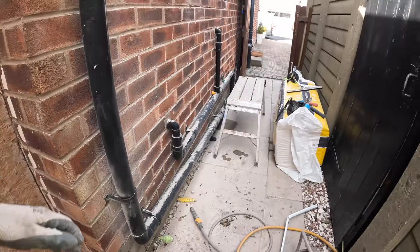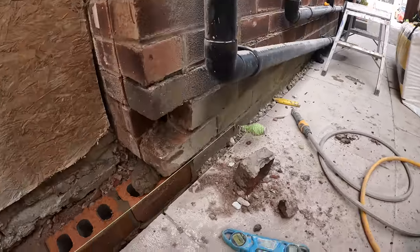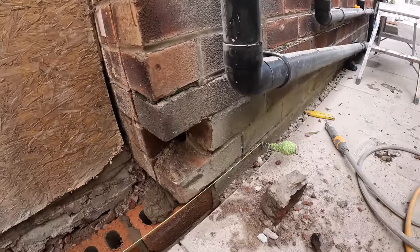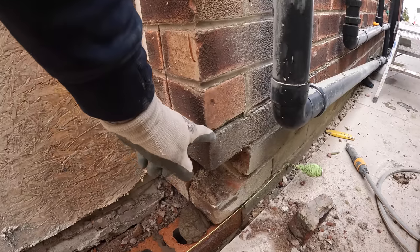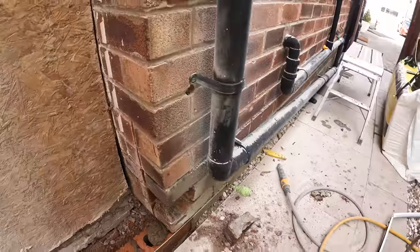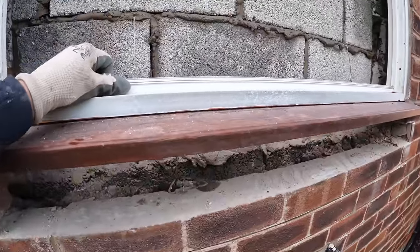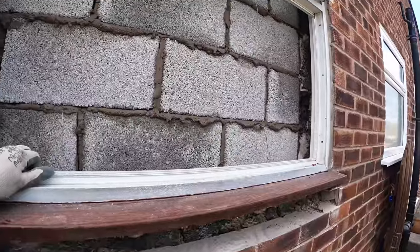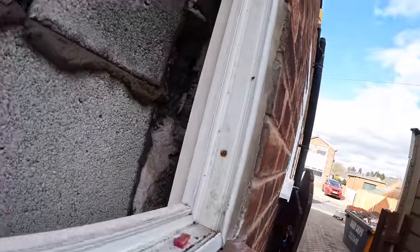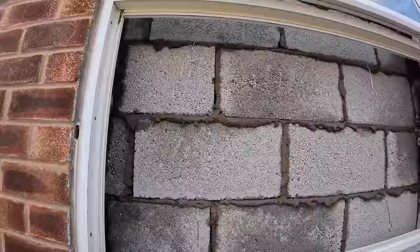Right. Here's one of those little hiccups. Luckily it worked brick, so that's two out. That's damp course, that's finished. Brickwork's finished there and it's blockwork from there, so two dots, keep it nice and tidy. It's aluminium, so we've popped the exterior beads out. Glass came out nice and easy. Just got six little tiny flathead screws to get out, and that frame will pop out then. And then that's ready for us toothing out.